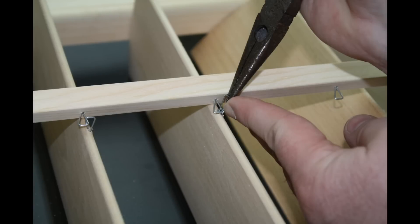The last step in assembling the shutters is connecting the control arm to the individual louvers using small barbed metal connectors inserted into the previously drilled holes using a pair of pliers. This part of the project was actually quite tedious, and the overall design of it is not all that great — it's my only complaint with this system. I hope Rockler will find a better solution for future kits.